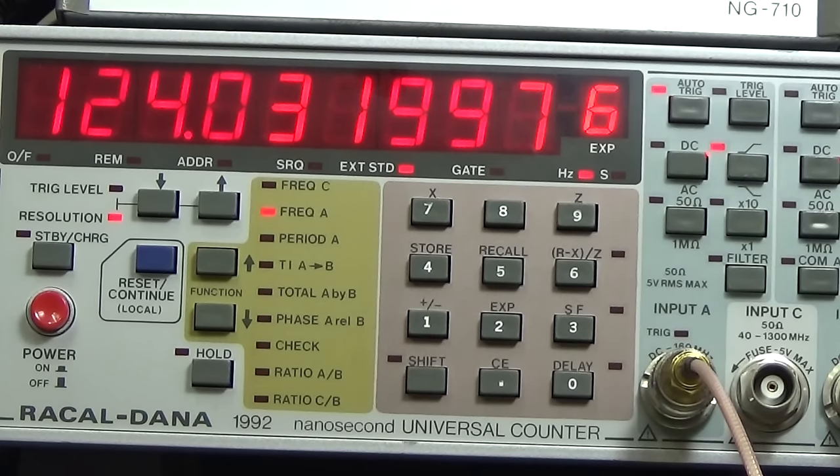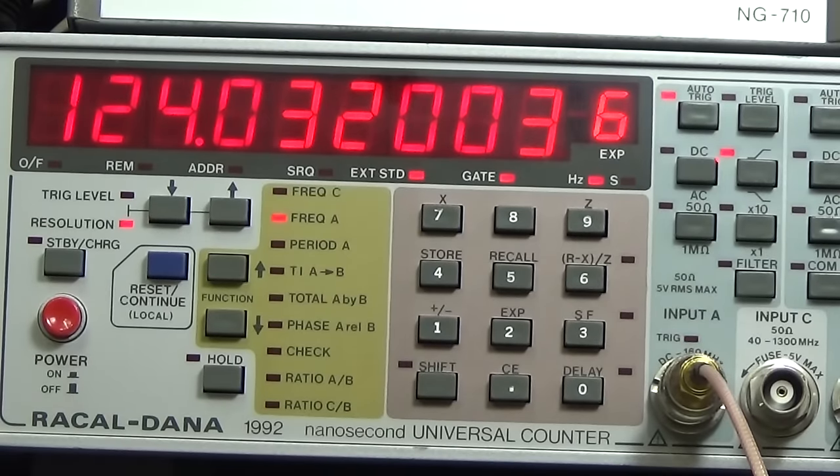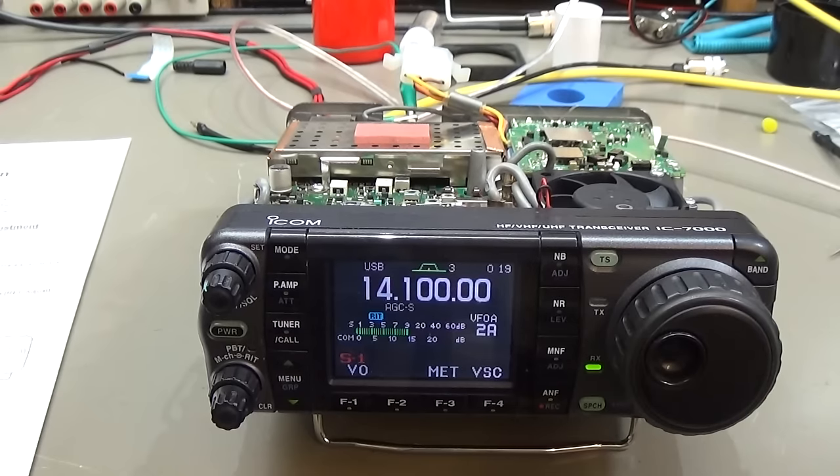We are now three Hertz off and that is obviously the best we can do because this adjustment is digital. We are not tuning with a ceramic screwdriver — it is set to adjustment mode and the adjustment is handled via the main frequency dial. When the setting is ready I simply press Set, which stores the new frequency in the radio's memory. You do not need a screwdriver any longer — everything is digital.